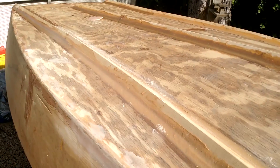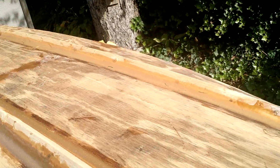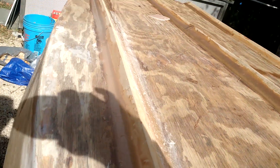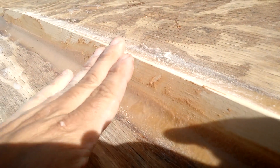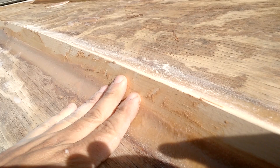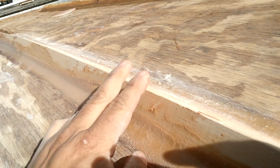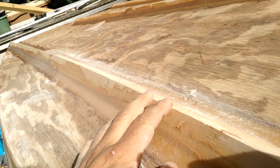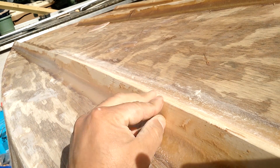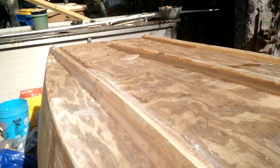I made that same mixture of epoxy and sawdust and created these fillets. I went ahead and hit all the strakes. The reason I did this is so that when I lay the fabric over it, it will actually lay in here — if it's a sharp corner the fabric doesn't like to fold. These sharp points here I'm going to take down to about an eighth inch to maybe a three-sixteenth inch radius to alleviate the same issue. It doesn't like any sharp corners. But I've got to do some sanding.